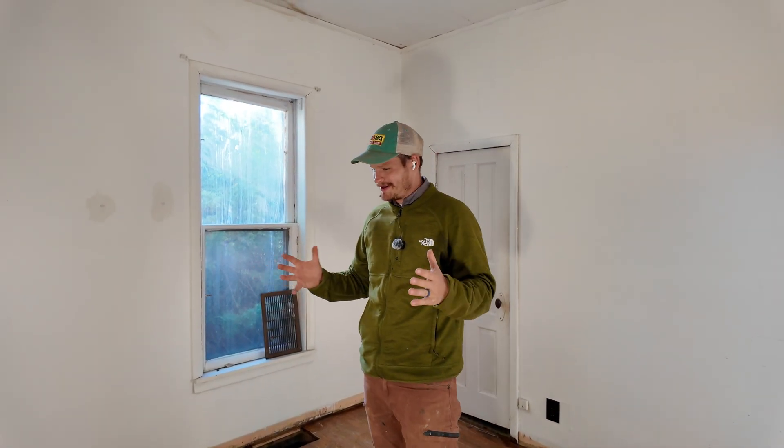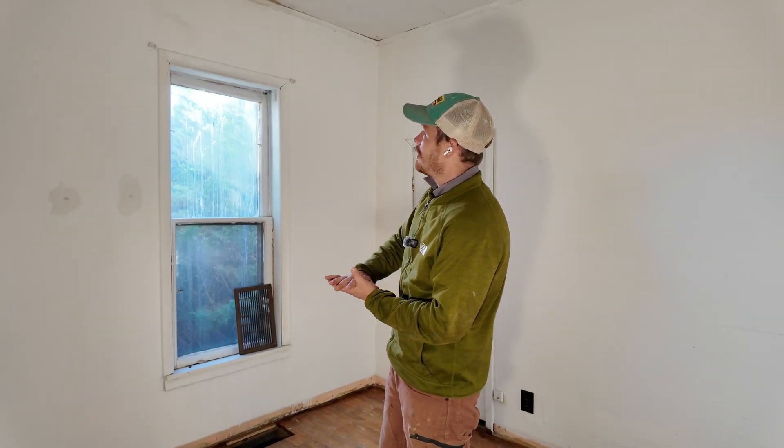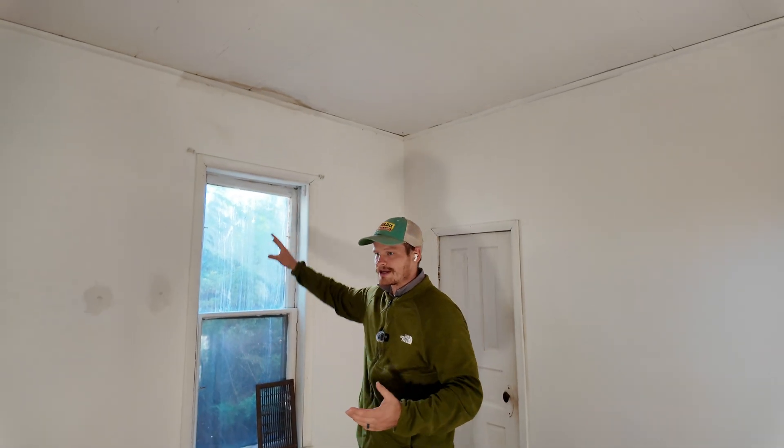When you walk into this room, you can almost feel the moisture hit you. There's a musty smell in the air — and to me, I smell mold. Underneath the walls there's this black powder coming out, which I believe is literally broken-down wood that's turned back into dirt. Up here there's clearly been a leak. On the outside of the house, it's that old split-face block, which is not good for moisture control — it leaves condensation on the backside, which can lead to mold.